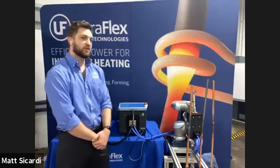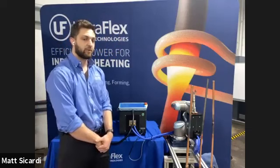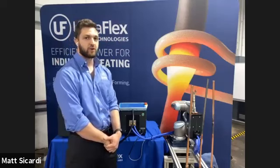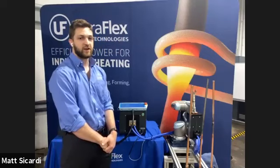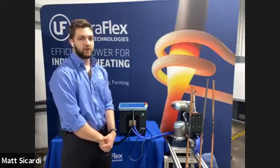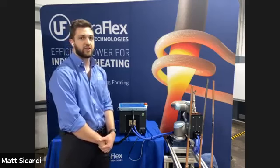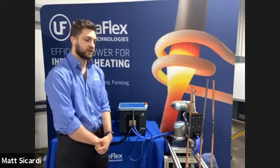The wire feeder option is one where it can also be mounted on top of the RoboBraze automation unit, which is also controlled by programming through the robot, the Universal Robots pendant. You are able to specify a feed rate of alloy, and it will feed for that amount of time through a single point during the cycle. That's to avoid the use of preform alloy rings.